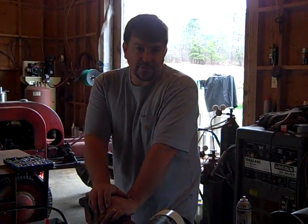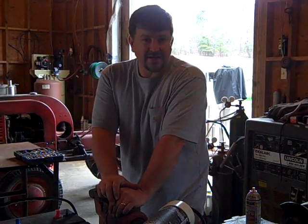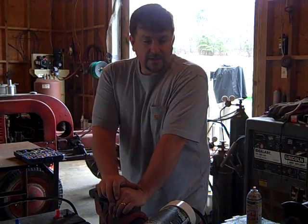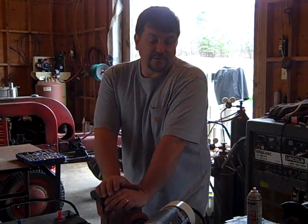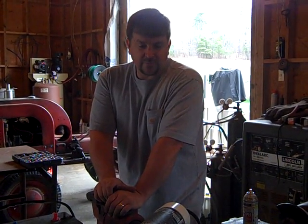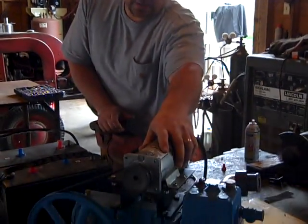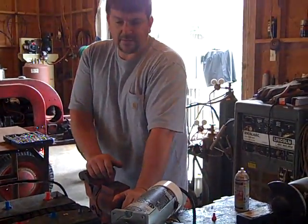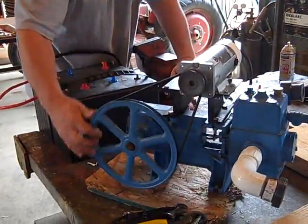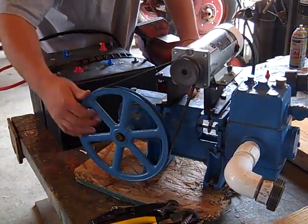This is video one — an introduction to the solar force piston pump. A pump that can lift water 230 feet, basically producing 100 PSI. Super quiet, does not need input filtration. You can filter after your pressure tank if you want. It's kind of where old school meets new school — newer style motor but an old school piston pump. The neat thing is you could actually take the belt off and pump water by hand, and I might be tempted to put a hand crank on this.